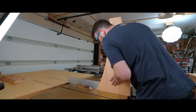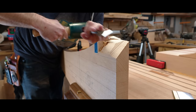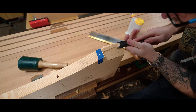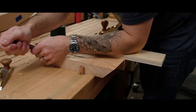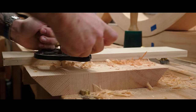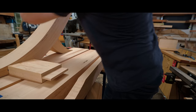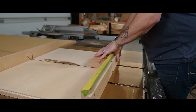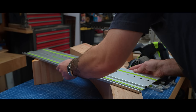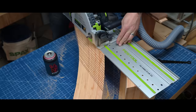In place of the support on the fourth corner is the stationary face of the leg vise, the top side of which is going to be mortised using a dovetail shaped tenon, and that keeps this jaw of the vise flush with the front of the bench. And a cross-lapped mortise is cut into the face of that curved leg to accept the curved jaw of the vise.